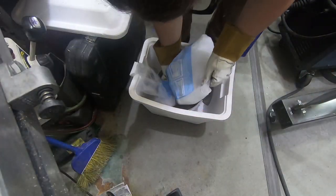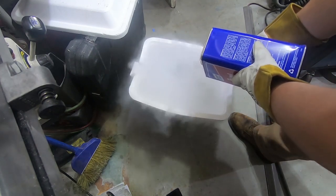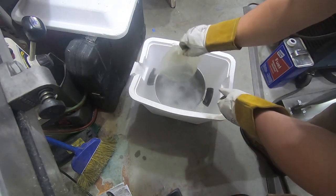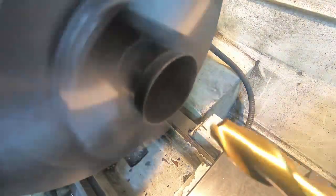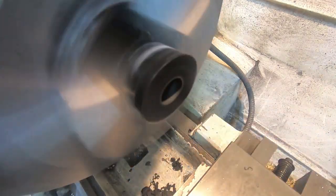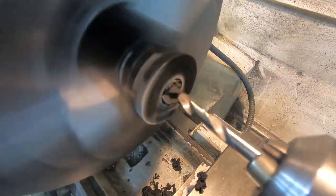The final machining task was to make the rubber bumpers. Sparks says these were bottle stoppers from their chemistry lab, cryogenically machined with liquid nitrogen. I'd been wanting an excuse to play with cryogenic machining, so I was really looking forward to this part. I decided to go with dry ice in a denatured alcohol bath instead of liquid nitrogen, as that was easier to pick up on my way home on the bus. Once rigid from the cold, the rubber proved very easy to machine, though it made weird chips that did tend to jam up in the flutes of an end mill. Each bumper stayed cold long enough to get the hole drilled and the counterbore made if I didn't mess around. Honestly, I probably could have just stuck them in the freezer overnight, and then my shop wouldn't have smelled like a frat party.